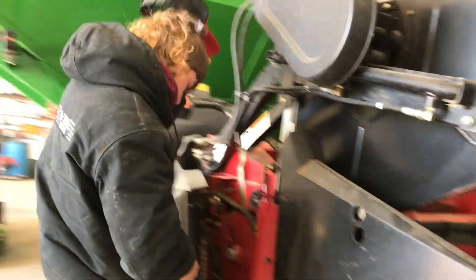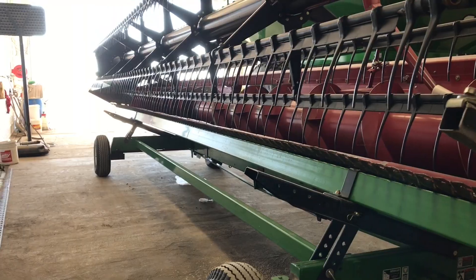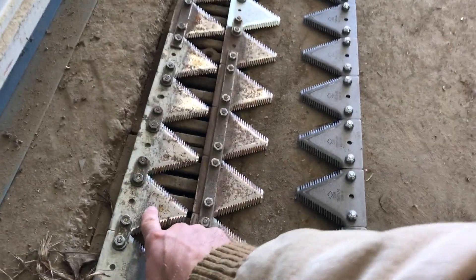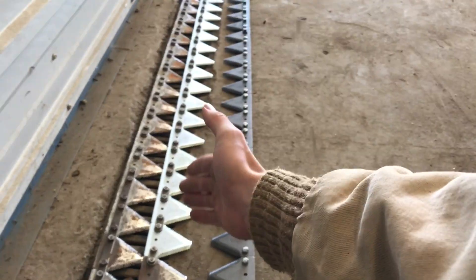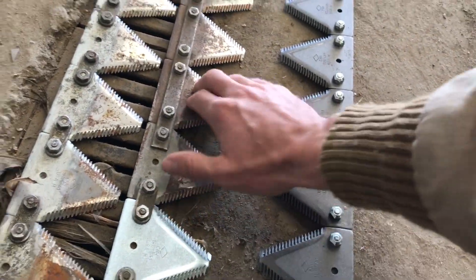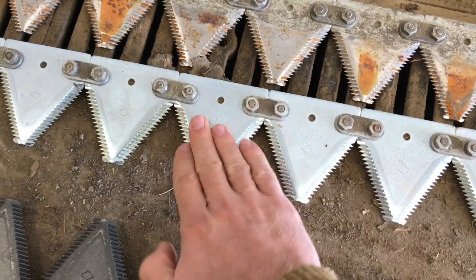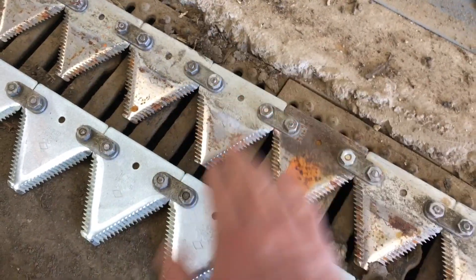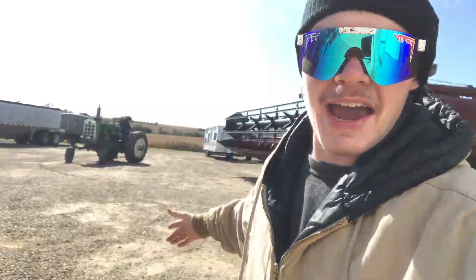The battery's dead — I just push started it. This bean head was in a corn crib that caught on fire. We got it out just in time. That's why this plastic thing here is all cinched up — it got pretty toasty. If you don't know what a sickle is on a bean head, I'll show you. These are sickles. We have three of them right here. This is the one that was on the combine. We had a spare one in case we had something break. We were going to replace all these on the old one here, but we did a price match and by the time you put your time into it, it was basically the same to buy a brand new one. So now we got three of them. This one has a lot of really good individual sickles on it, so if we hit a rock or something and break one of these, we can easily pull it off one of these. Then if we break a bunch of them, we can just slap the new one on real quick. Each of these come in individual sections — you just take these off, pop that off, put a new one on, you're good to go. There are quite a few sickles on here that are still fairly decent, so we'll pull the good ones off. Then if we hit a rock and break these off, we can just slap a good used one on and it'll still work just fine. Took me so long to record that that Cooper got the bean head on in the meantime.